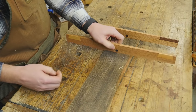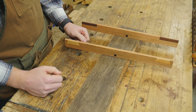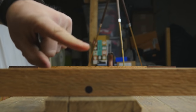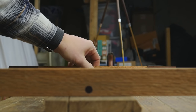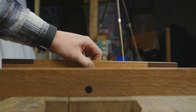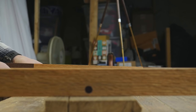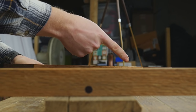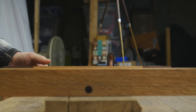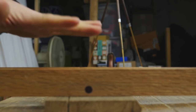Some people will also make them fatter at the bottom so they stand up — you can if you want to, it's not necessary, but it's another special thing you can add. Looking along the sticks, you can see they're fairly well parallel — there's about the same amount of height sticking up above the front one on each side. You can move them along and see where the twist is in the board. If there was a wind in the board, it would look something like this — you can see how there's more of the dark spot on one side. You can easily read where the twist is and remove your high spots with your plane to get a nice flat surface.